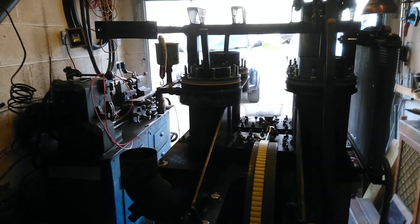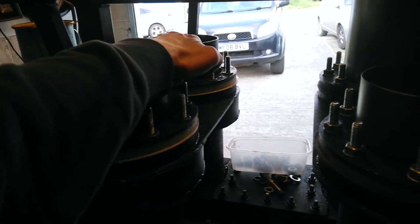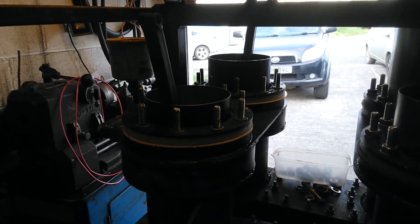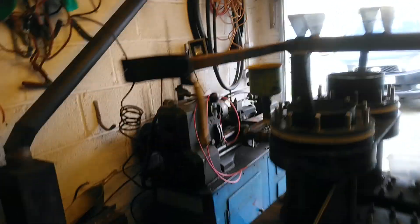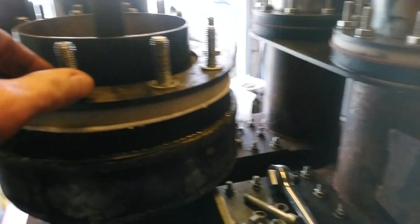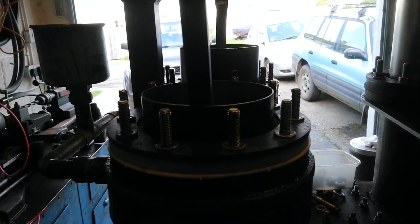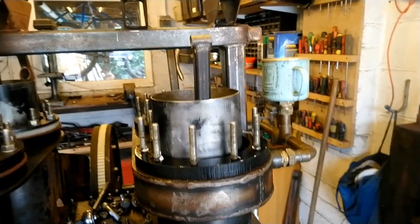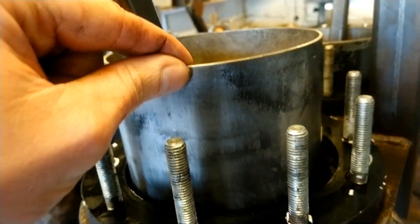Here I am in the garage again. What I've decided to do is pull the two hot cylinders out - this one and this one - and see what's going on, because there's some nasty clonking noises coming from them. I've removed the assembly that goes on top, unbolted everything, taken all the bolts out, and I've just removed the PTFE seals. Everything's looking okay here actually.